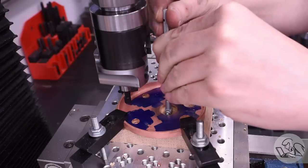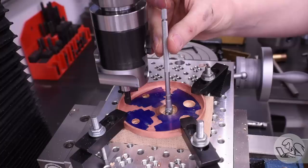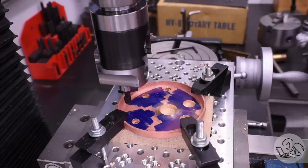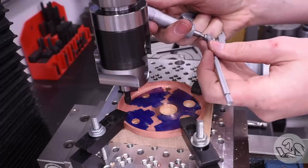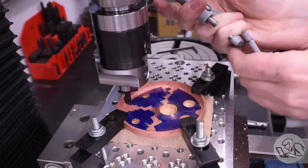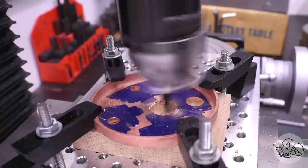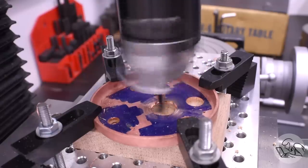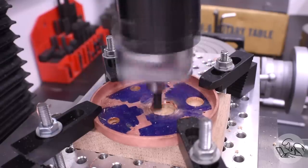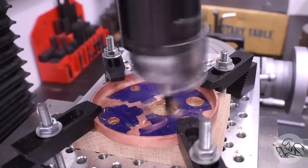So you saw me using mine for making these hardwood formers in the last video, but Kozo actually demonstrates a method for doing that without the rotary table, involving a hand-built wooden structure with a long lever arm. I did it on the rotary table because I happen to have one, and I'm doing this with my boring head because I happen to have one. But again, Kozo assumes a very simple set of machine tooling, so that's a nice thing about his books, and don't think that you're gonna have to invest thousands and thousands of dollars in tooling to build his engines.